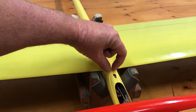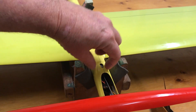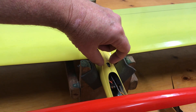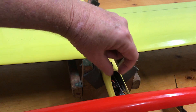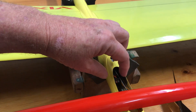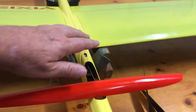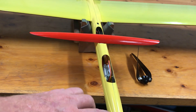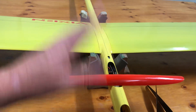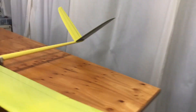Keeping the servos up the front was problematic. When it was an F3J model, the push rods came out too narrow to fit anything between them — they were offset from the side of the fuselage such that I couldn't fit a receiver or a battery pack in there, so it was just wasted space. I really needed to keep as much weight back as I could, and it just worked out that the servos in the tail end made sense.